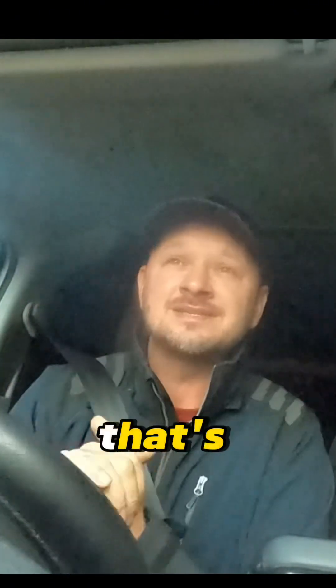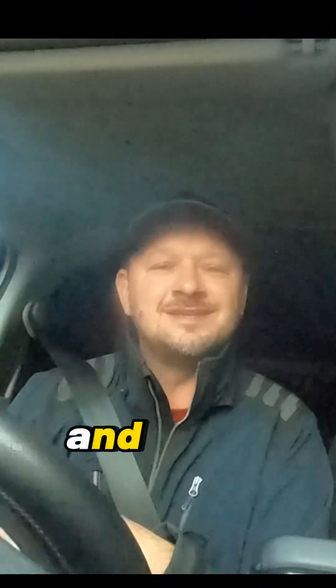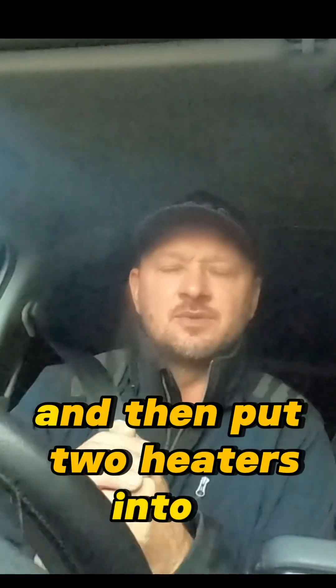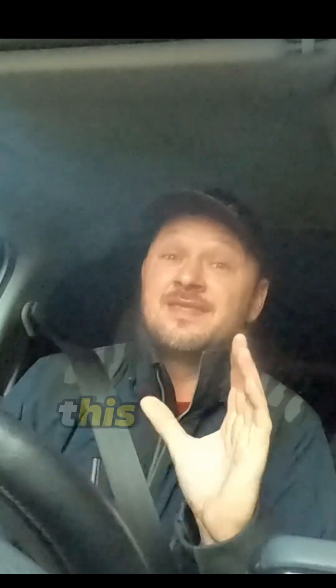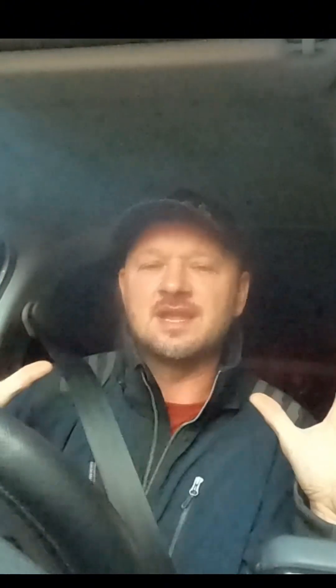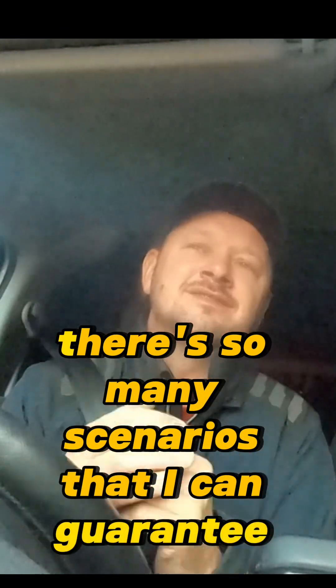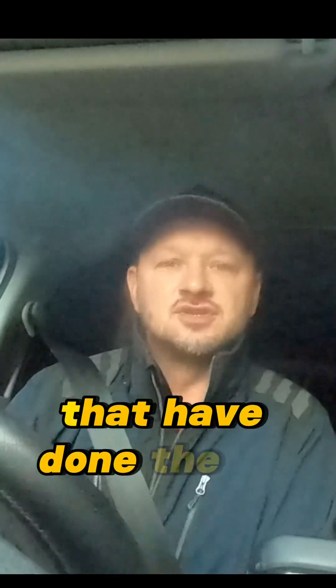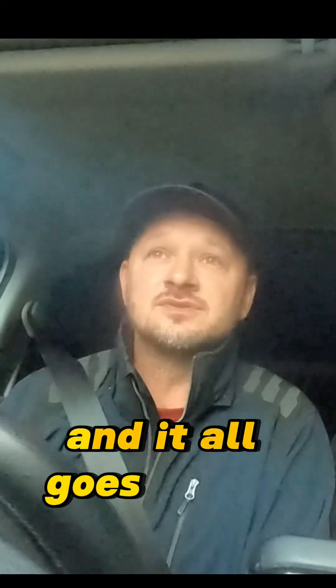Unfortunately it's a bummer, and I hate it sometimes. Because people phone me up and say this has happened, that's happened, and I need you round here. Because you've extended it yourself and done a little bit of work yourself - you thought you had a socket, so you ran a bit of 2.5mm cable off the ring main and put two heaters into it. It doesn't work like that. This is the whole reason why you call an electrician to do it. There are so many scenarios that electricians have been called to fix, where cowboys who aren't qualified have done the job themselves and it all goes wrong.